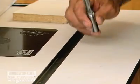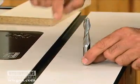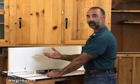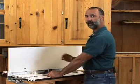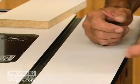I actually prefer a spiral cutter like this one. The reason is that the spiral bit is going to do a nicer job on that edge band, less chance of chipping. At this point, we're in so deep, the last thing we want to do is put a big chip in that edge band. It'd be really hard to repair. So the spiral bit in the router table is going to do a nicer job.